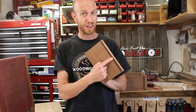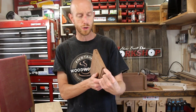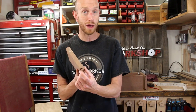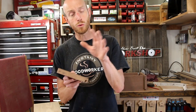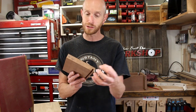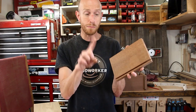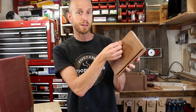I'm pretty sure I just made a mistake. I cut this thinking I was going to miter these at 90 degrees which would hide the end, but I wasn't thinking that the finger joint is going to have this end exposed. I'm not going to waste this piece of wood — I'll move on and try to hide this by patching in a piece. I just want you guys to be aware of this potential issue: if you're going to build a box like this, make sure you take into account all cuts, slots, grooves, and dados before you move forward so you won't end up with a visible slot. I need to make a similar groove across the top, but after this one I'm going to wait until the finger joints are done so I can position it where it won't be visible.